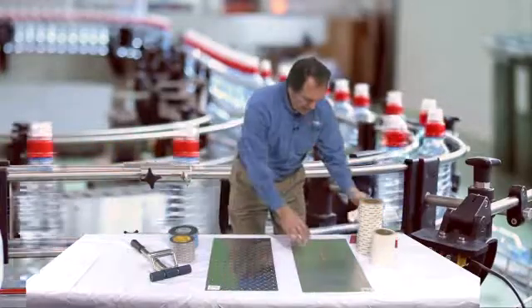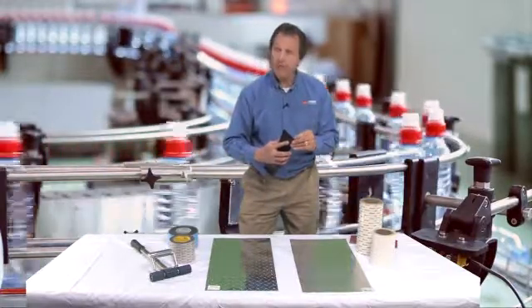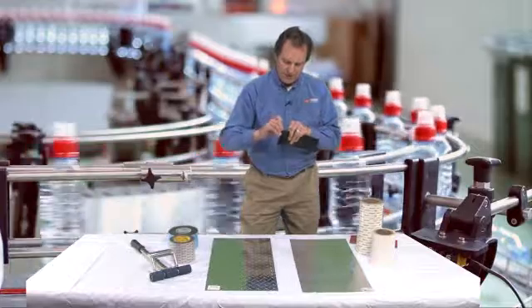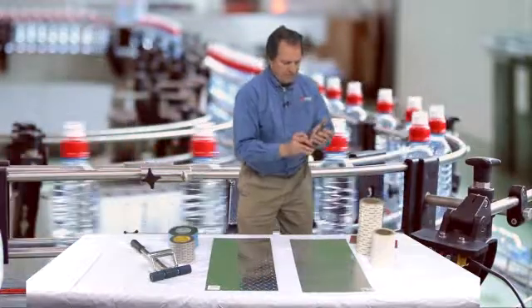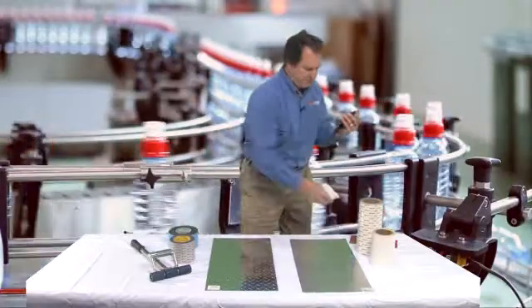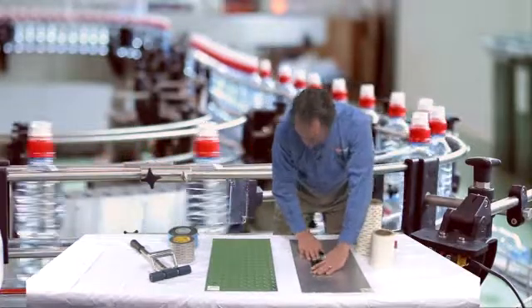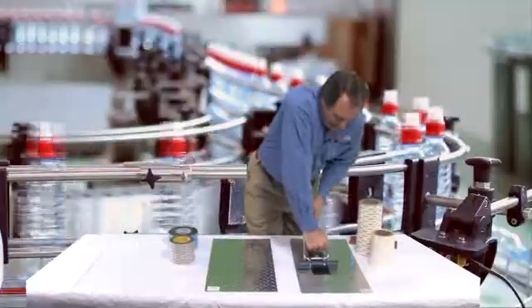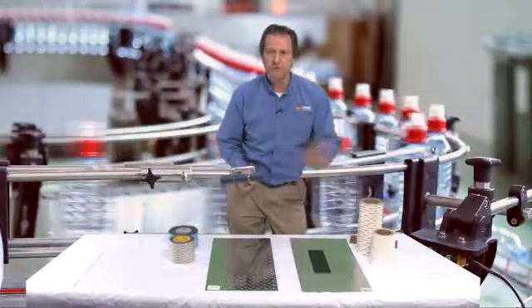What I'd like to do real quickly is take a piece of UHMW — this is about a hundred thousandths of an inch thick — and this is actually laminated with the Avery 1191, so this is 11 mils of adhesive. We're going to peel the liner off and bond this down. We should actually be able to push this down into the highs and lows of this substrate pretty well. Once it's in place, you want to use the roller and apply good mechanical pressure. Keep in mind that when you use a roller, you will literally double the bond strength. Hand pressure is never sufficient, so always remember to use your roller. And there you see, we've got a very, very good sufficient bond.